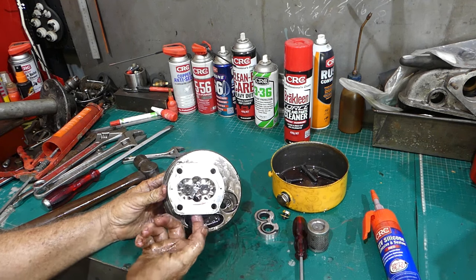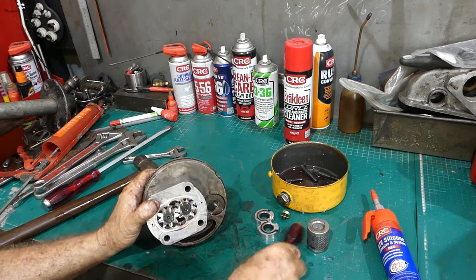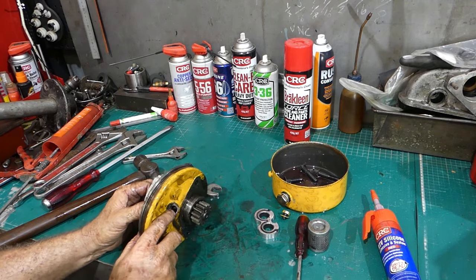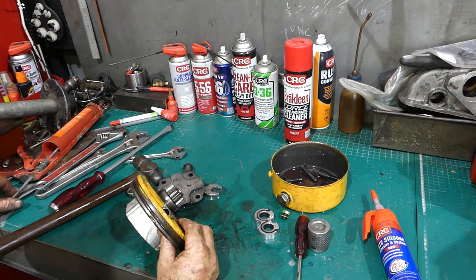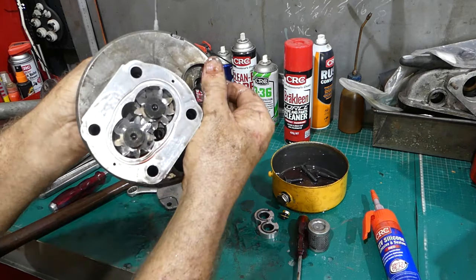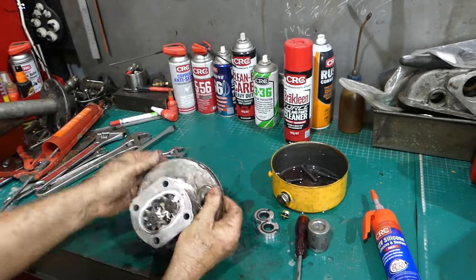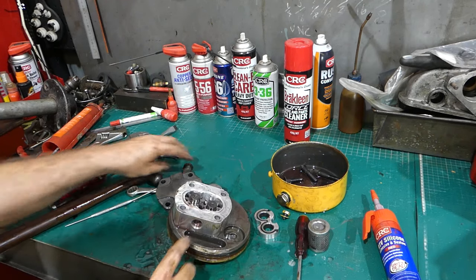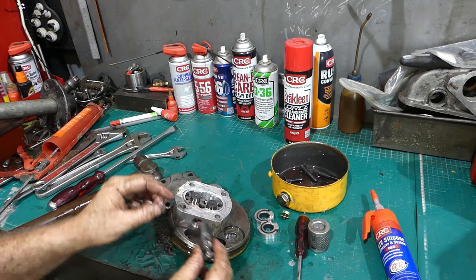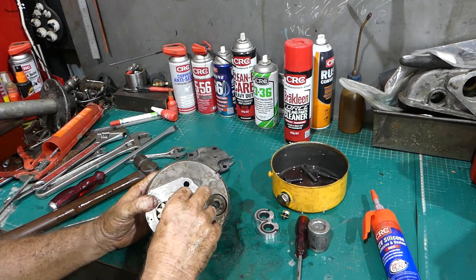and brings it out past the relief valve here, and on the other side of the relief valve here is this fitting here. So we could probably see if we can put an O-ring pick down there and show. Yeah, so that goes through here and out the fitting there. Your relief valve's here, so if the pressure gets too great, it returns it back in through these holes here. The ball comes off the seat, returns it back into the canister there. All in all, look, it's not as bad as I thought it might have been.